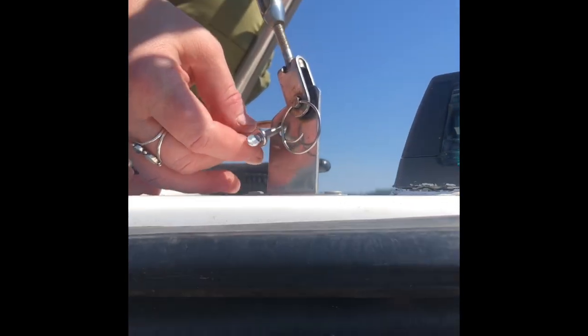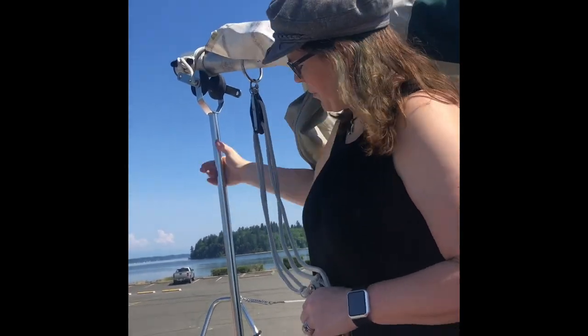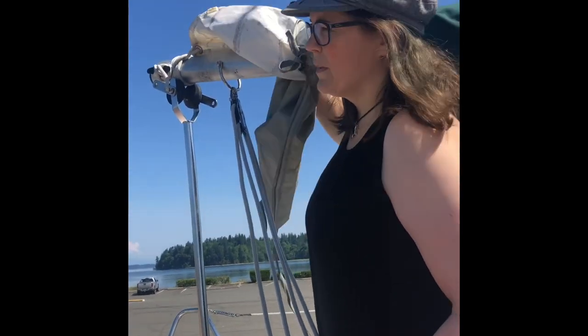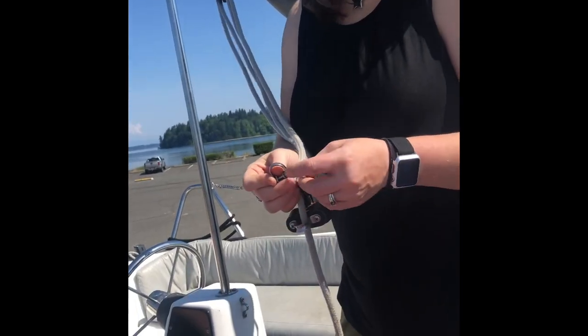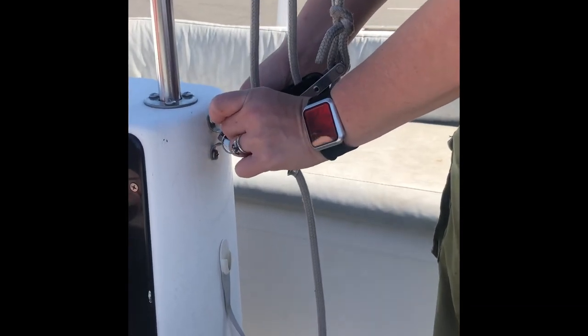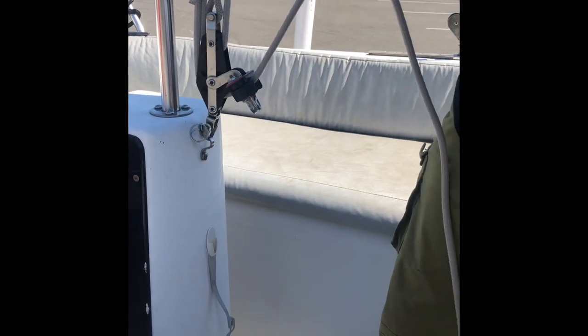The jib is attached to this D-ring. I made this sail cover for the boom — it's not professional at all, but I'm just resting this on top of the mast crutch. We leave the mainsail on top of the boom. This gets attached again — we've got another little O-ring, and this little pivot thing comes out. Then I'm going to attach this through here and put this pivot pin back. You just slide this back through it and then you can cleat that up and it holds it steady.